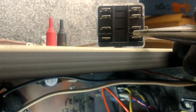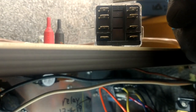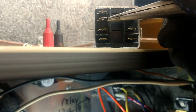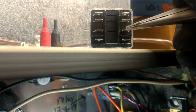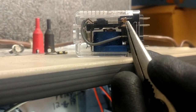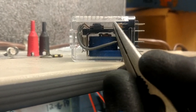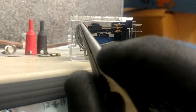You've got a set over here and a set over here. The two terminals down at the bottom are 24 volts. From the top down to the bottom is normally closed. The normally open is from the middle down to the bottom, and both sides are identical. If you look at it from the side, there's your contacts - you can see a brass plate going through that gray wire down to the bottom.